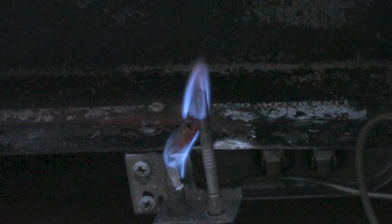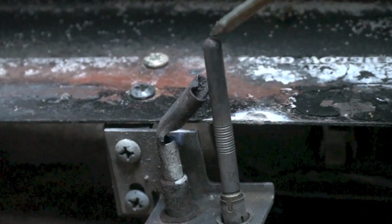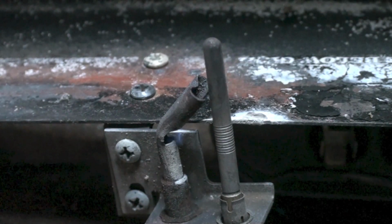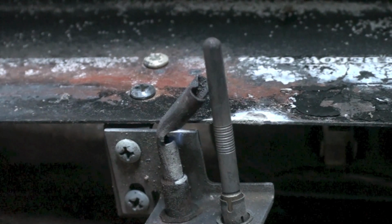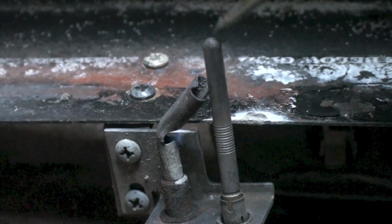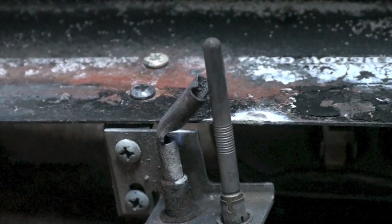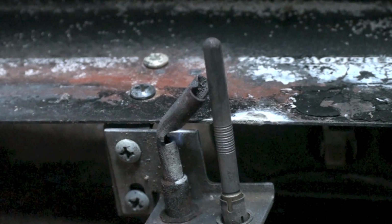So what's actually inside? Okay, the jacket of this thing here is made out of stainless steel. That's one of the dissimilar metals. The reason it's made out of stainless steel is I can put a flame on it and it won't deteriorate. Some other metals, if I put a flame on them, they'll eventually oxidize. This stainless steel will not. So it is welded or brazed, whatever the heck, to a very small little piece of wire inside there that is called copel. It's a mixture of copper and nickel.